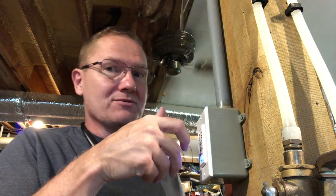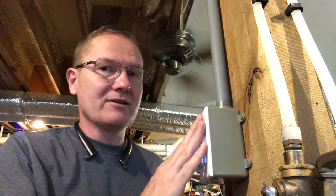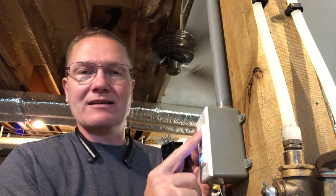It's going to work better than the mechanical one, which over time gets dust and grime in it and just doesn't work as well. This took about 15 minutes to do the whole changeover. This can be done in the house too — if you have a switch not a dial, this is the same concept. If you've got one switch that's on for the fan and a separate switch for the light, you could put the timer in there following pretty much the same things we did here, and be able to control your ceiling fan with a timer. This is John Young with The Weekend Handyman — thank you for watching.